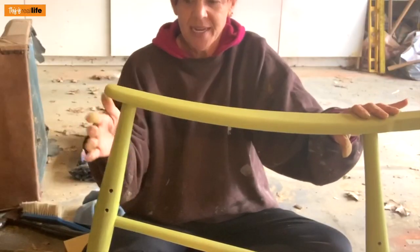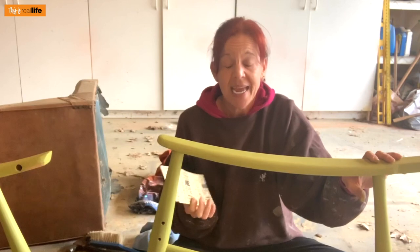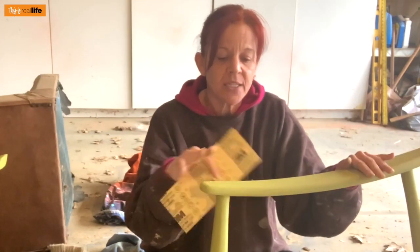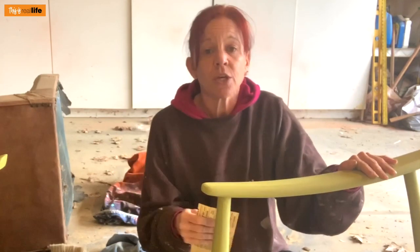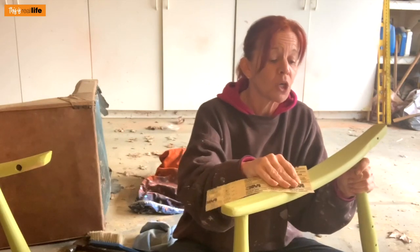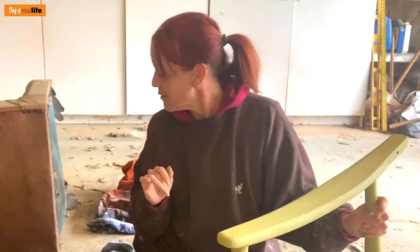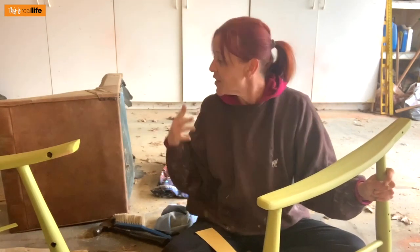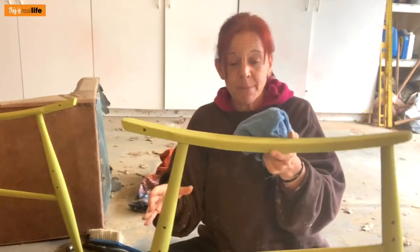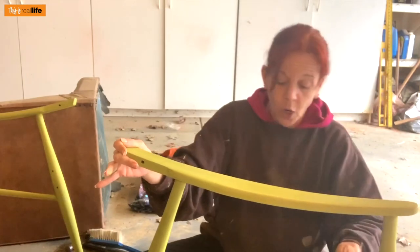Cutting in done — let's roll. This color is great! I just can't hide how excited I am. Coat one is on. Now I'm going with 220 grit — a very fine sandpaper — and I'm going to lightly sand to smooth out imperfections after the first coat. After your first coat you can see some imperfections, so we just lightly sand those off to make coat one as smooth as possible before putting on coat two.